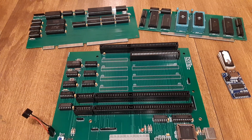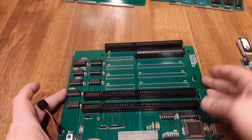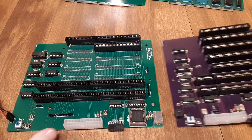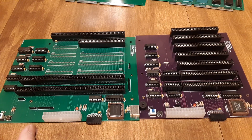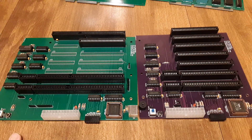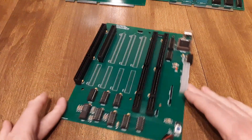It doesn't work quite yet, but it does boot up a little bit. To start with, I've got the main board. As you can see, all I've done is expanded my 8-bit board. You can see side-by-side here — they're pretty much identical, just now I've got a 16-bit wide data bus. This part of the project is probably correct as far as the build goes, because all I had to do was expand the slots and then add some pull-up, pull-down resistors.